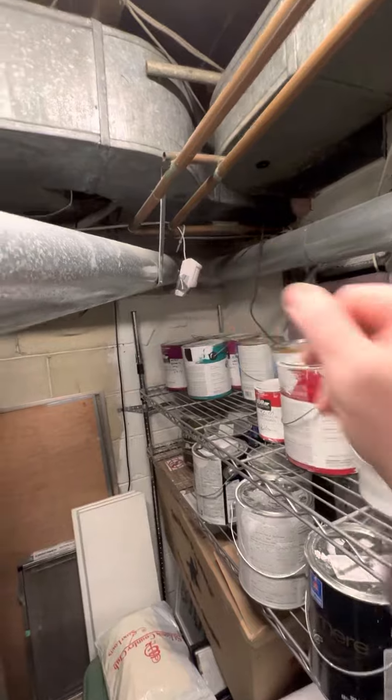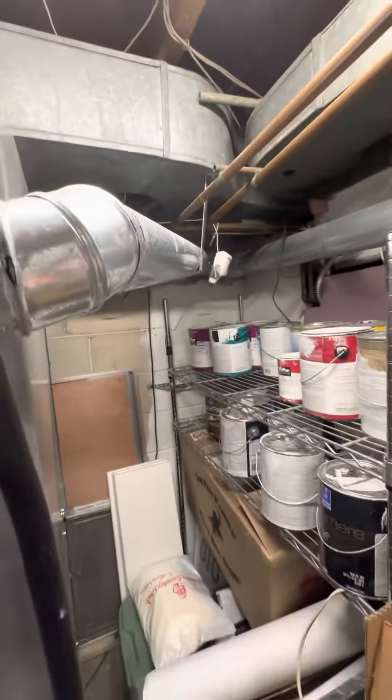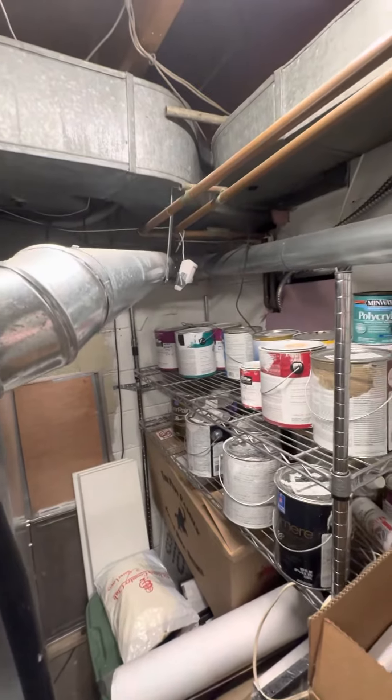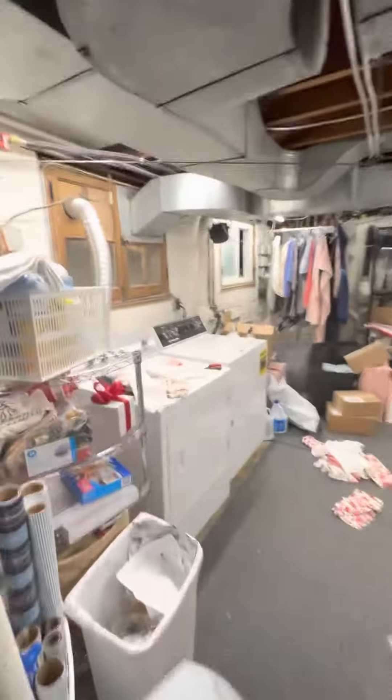You'll need a four-inch cap for this unit going out the chimney in the back there. The big issue is that this home has been added on to, so this is no longer an exterior wall. This is not an exterior wall — the only way to get out, and they even built over it, is back here.